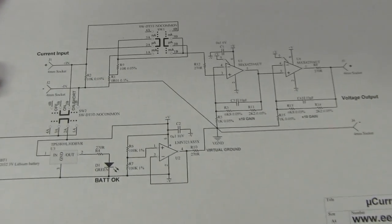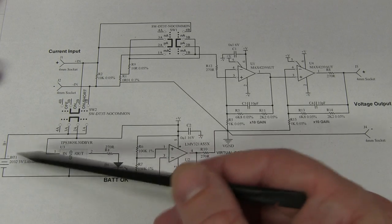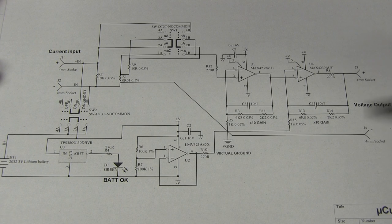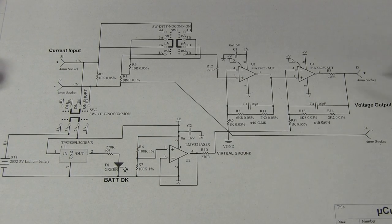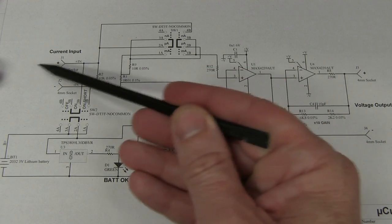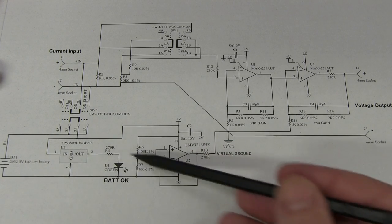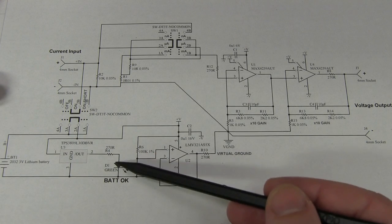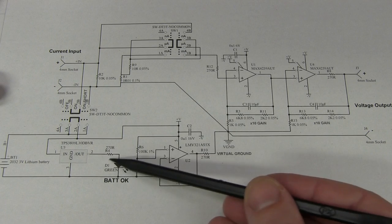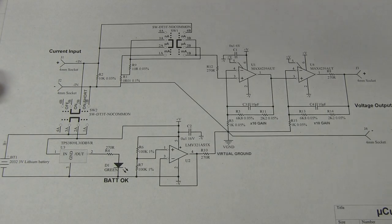Looking at the new circuit, I need to replace the battery input so I can power all ten boards on the panel. I need to measure the output voltage, and I've got my input current connection. Ideally I'd want six connections: inject a test current, measure the output voltage, and power the device under test. I've also got a battery load detection system, so it'd be nice to test that — feed in 3V and make sure the LED lights, then drop it to 2.65V under the 2.7V limit and ensure the LED goes out. But I only have four connections available.